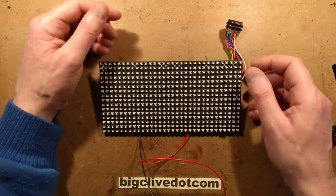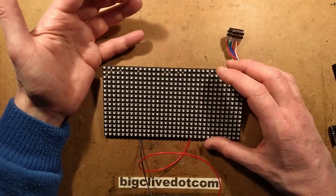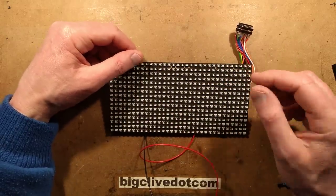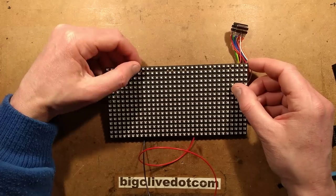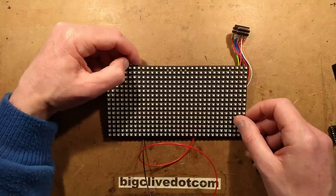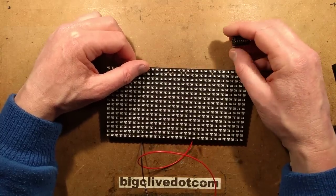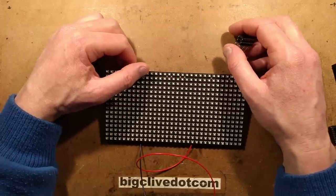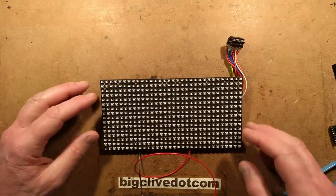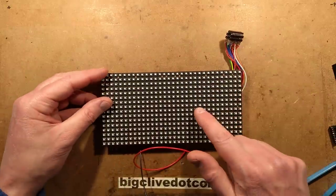It just makes you think differently. I've seen video walls but never realised what's inside is so traditional and not very intelligent. It's basically shift registers with the multiplexing done by clever hardware at the back that receives the video signal and converts it to scan the display in real time. I'll link to the code below, put up the hex files so you can copy it into a chip, and also put the assembly files up so you can read and modify them.